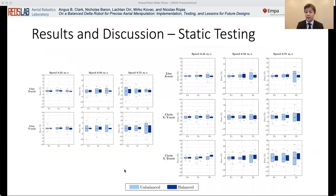From the results of the static testing, we see a reduction in shaking forces for all trajectories for the balanced manipulator in comparison with the unbalanced manipulator. Across the three speeds evaluated, there was on average an increase in experienced forces with an increase in the end effector speed. Interestingly, this did not increase equally across all axes. For example, FZ along the Z axis showed a significant increase with speed, whereas FX and FY only had a minor increase. Overall, the static testing results demonstrate that at higher speeds, when more extreme forces are imparted on the mount, the implementation of a balancing system provides more consequential gains. On average, the balancing system is successful at reducing the experienced forces across all axes at all tested speeds.